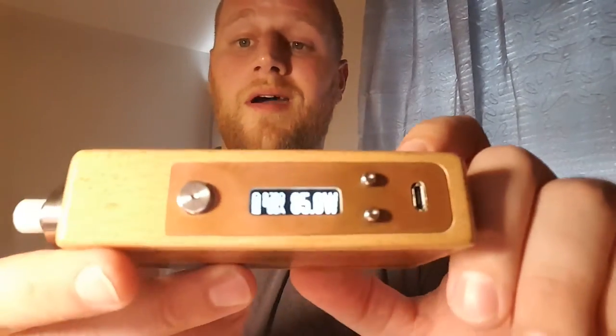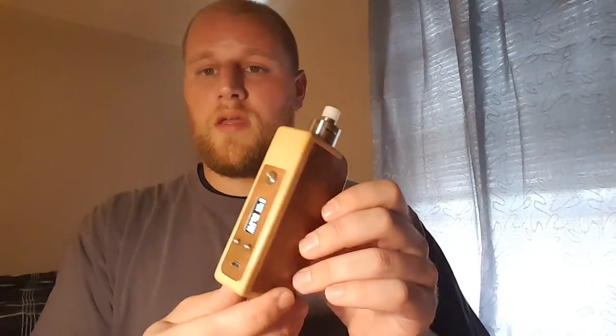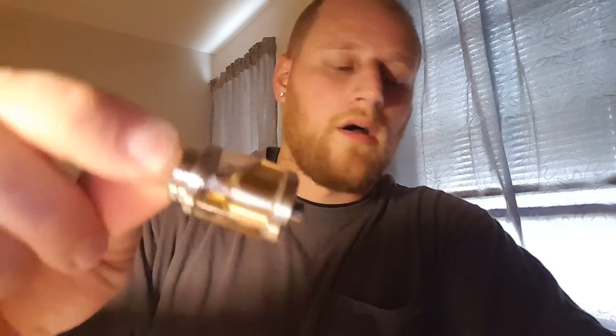The build is done. I'm definitely going to get back into the dual 18650 setup to figure that out — it really pisses me off, honestly, because that's what I want to run it off of. With these LiPo packs, people try to tell you that 900mAh times three cells in series gives you more capacity — that's not how it works. You don't get more milliamp-hours adding cells in series; you increase voltage. You're hitting each cell softer, but it's not equivalent capacity.